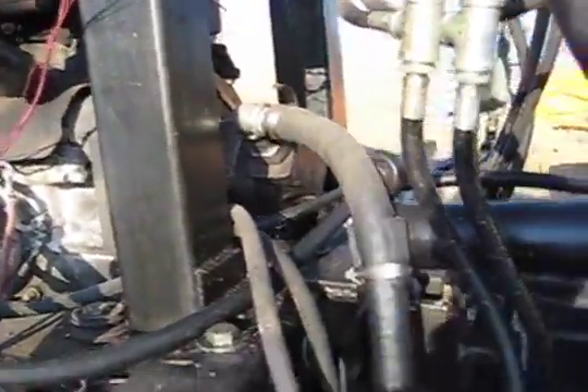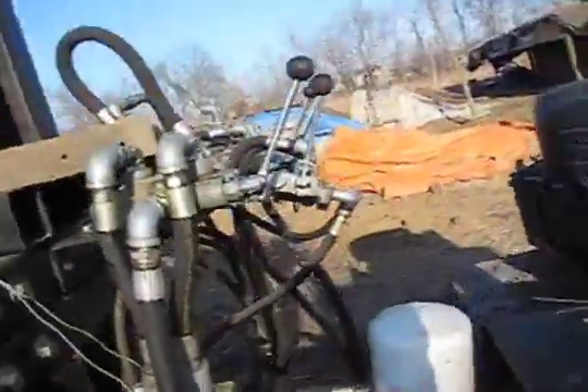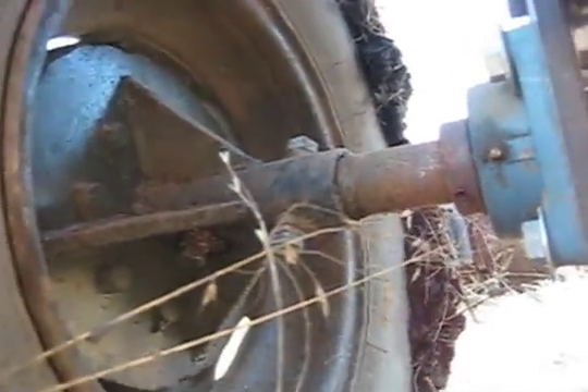Here, let me show how the wheels attach. You've got the wheel motors that are all powered by the hydraulic pump which is in the back of the engine — all the power of the entire device goes through the engine through the hydraulic fluid. The motors are essentially just two bearings attached to the hydraulic motor through a coupler, and the wheels are just a simple welded-on plate that attaches to the wheel with bolts. There's a spacer to make room for the coupler between the motor. The hydraulic motors are about 10 horsepower each and we've got four of them for four-wheel drive.